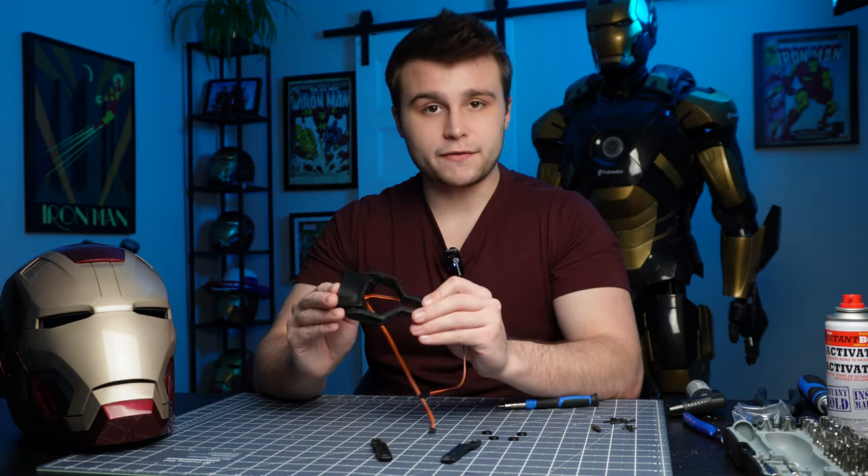That covers pretty much all the parts needed for motorization. The very first thing you need to do is sand all of these pivoting points - that includes the helper arms, the servo driving arms, the little mount piece, and the pivots built into the helmet. When 3D printing you don't always have the best tolerances, so to make sure things move nicely and smoothly without getting stuck, we need to sand them with sandpaper and files. I've already done that for the inside of the helper arms, so now they're moving nice and smooth. Once all your parts are moving smoothly, the very first thing you'll install are the helper arms, because the pivots built into the helmet are a fixed point you can't adjust after installing the rest.